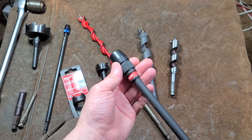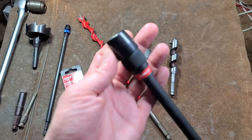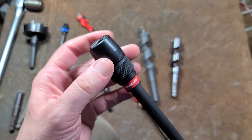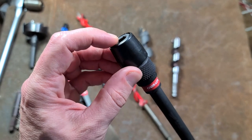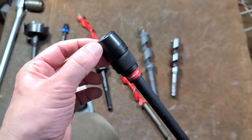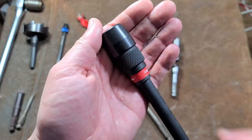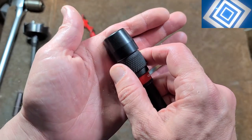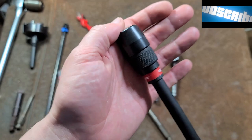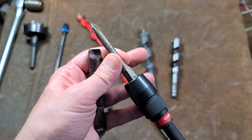This Insti-Bit three ball-bearing roller lock design is really excellent. The bearings ride in tracks cut into the receiver, and the outer collar reinforces the inner part as well as providing the taper that the ball bearings ride in. This collar at the bottom pushes up on the bottom of the ball bearings so that they stay tight when you push in a bit.